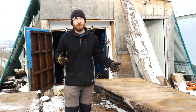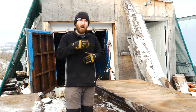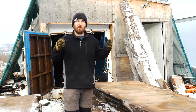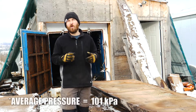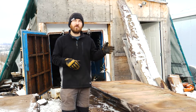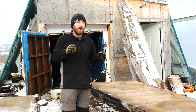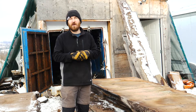A lot of people ask: what's a vacuum kiln? There are a few different kinds. This one specifically is a radio frequency vacuum kiln. Basically, there's a chamber that all the wood slides into, the door closes, and then we initiate a vacuum pump which sucks out the majority of the oxygen. By removing atmospheric pressure we're able to vaporize water at a much lower temperature. Out in the standard atmosphere we're at about 101 kPa; inside the kiln, once the vacuum is on, I pull it down to about 7 to 10 kPa, which boils water at around 38 to 42 degrees Celsius.